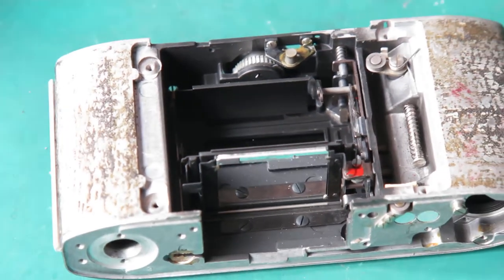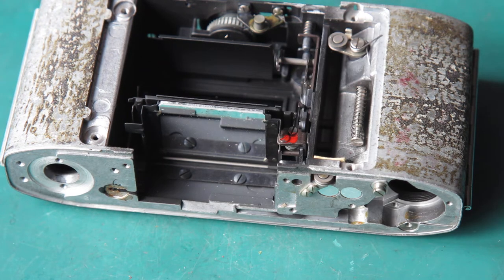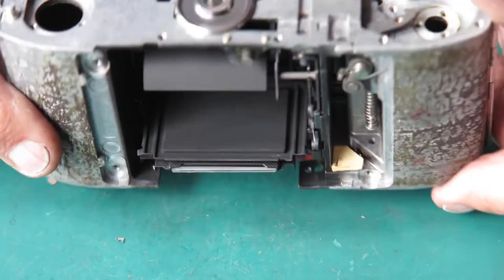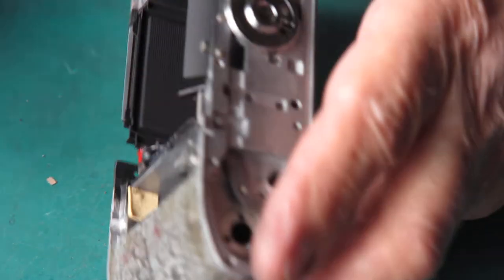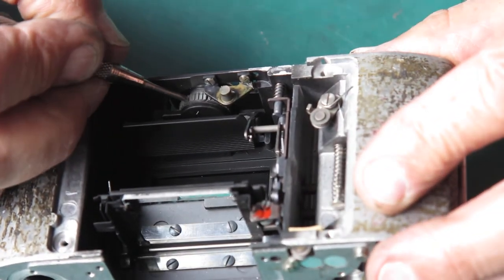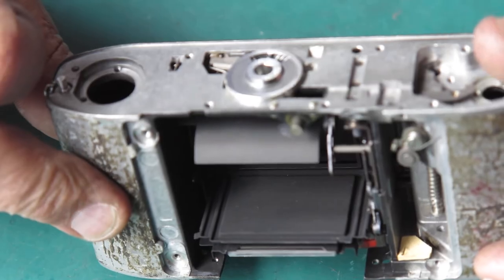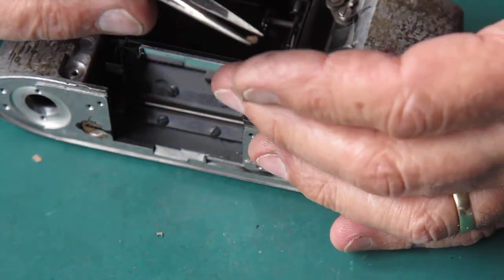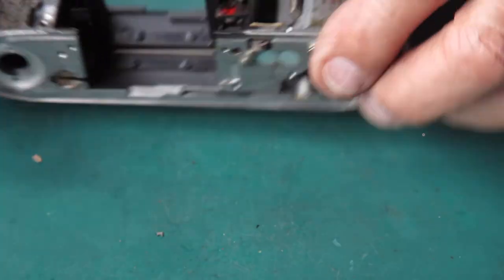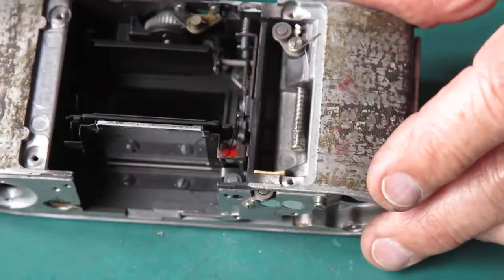This mirror appears to be glued to its plate, so I'm going to leave it exactly where it is. I'm not going to fight for that — fighting with it is likely to lead to a mirror with a great big crack down the middle. The frame counter — let's see if it moves nicely. It counts up; it's got a spring to return it when you open the door, and that returns nicely. That's reasonably tidy. Look — here's another film chip, going all the way through this camera.